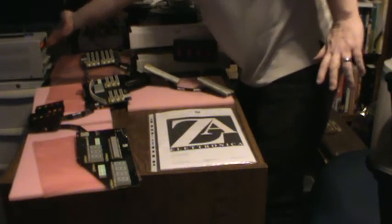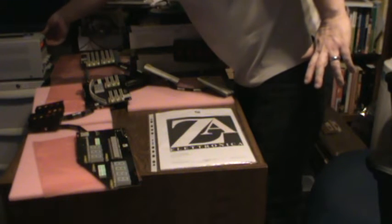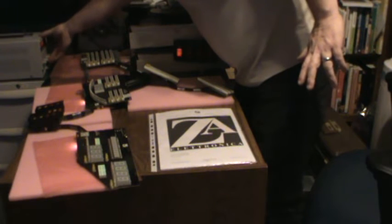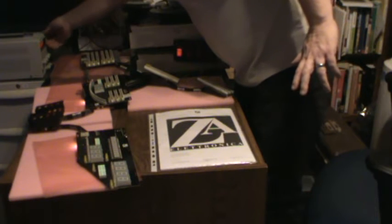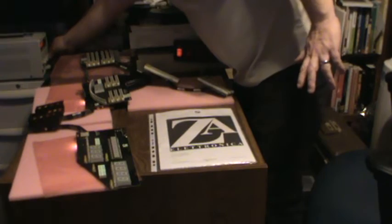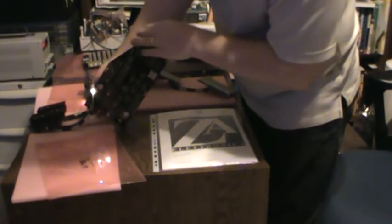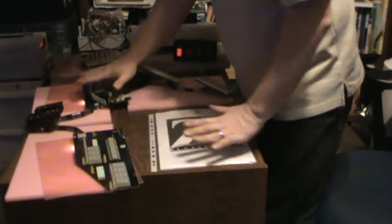Power supply here is running 12.8 volts. Well, 13.8 volts is what my car runs normally. You see the power light came on. There are some LEDs on the back. He mentions this on his website. He's got some white LEDs on the back of his boards so that if you ever need to look back down under here to see your original dashboard gauges, there's some little LEDs back here to help you see those. It's for diagnostic purposes. There's one behind the speedo and one behind the tack.